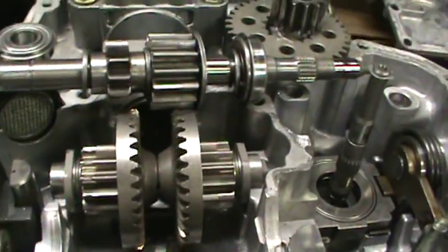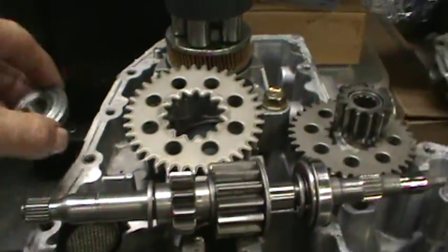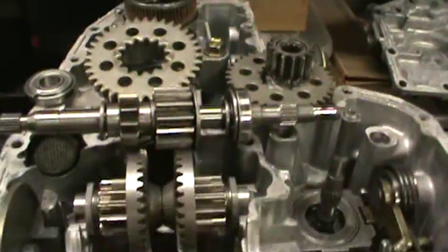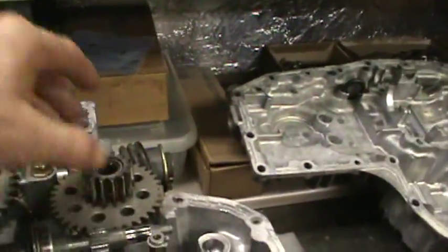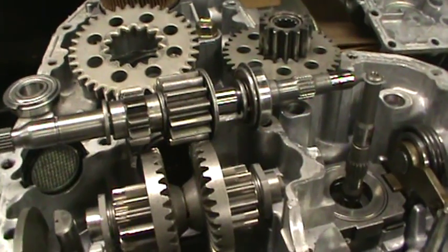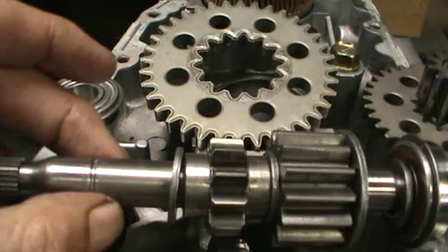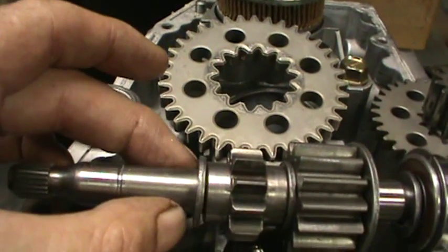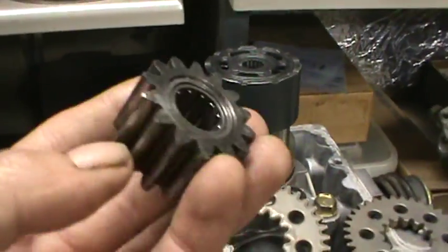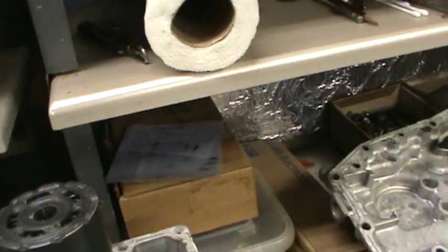On this side, so major issue. It also damaged the bearing on the outer end of the reduction shaft here. I priced the parts and it's prohibited — even think about buying a new reduction shaft and this pinion gear. So I think I've found a workaround for this. What I did was to have a machine shop use the HVOF — high velocity oxy-fuel — spraying technique to build the shaft back out to size, recut the groove in it, also resize the inside of this pinion gear, and we found a new bearing to fit that. So that stuff is all good to go.